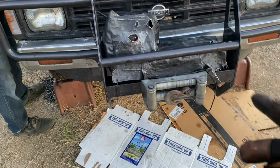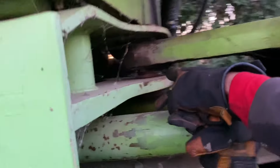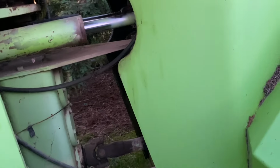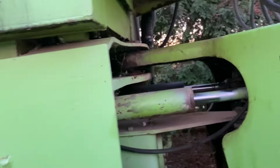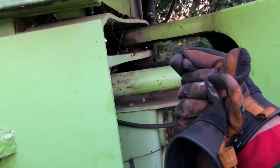Okay, so let me explain. On the Bearcat 1, we did a hinge pin. Let me go over to the Bearcat 1 so I can give you a better demonstration. So here on the Bearcat 1, what we did was we did a hinge pin job. So if you know what that is, that's changing the pin up here and down here. And so basically you just gotta jack up the tractor here and here and put on blocks. And then you gotta pull this back. So when you take those out, you pull it back, right? And what we did was to put this tractor back together after it was apart. We used the winch to winch it together, to winch it into place. And that truck actually winched the tractor back together.